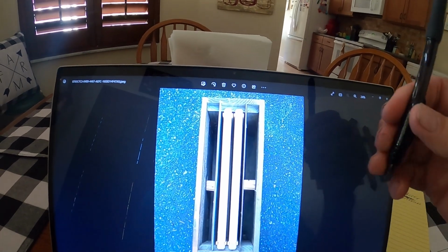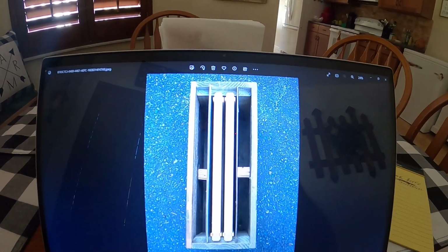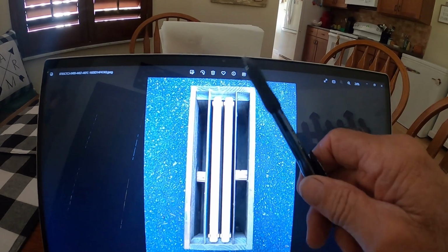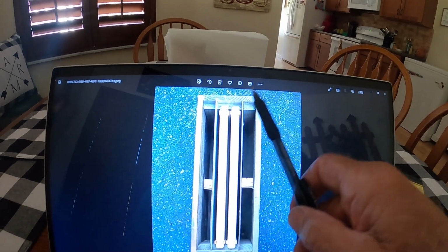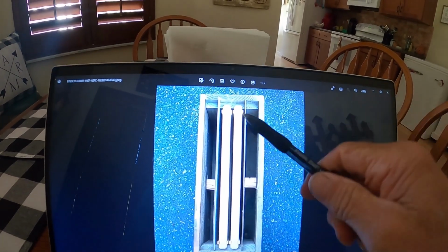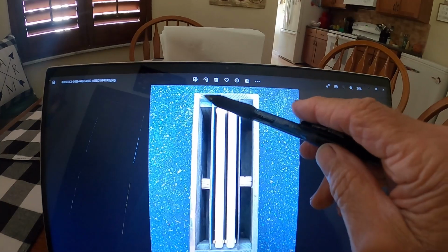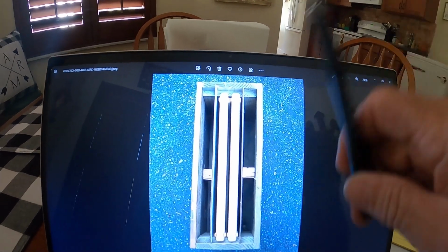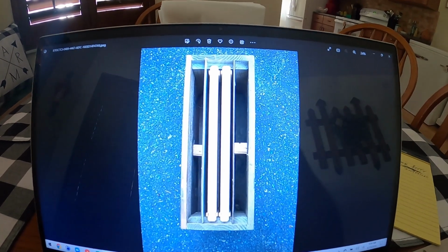I built five of the two frame boxes, but I think I'm going to discontinue that. Use what I have, of course, but I have a lot of 2x ends. They're already pre-cut to 10 inch. I'm going to do a scarf and glue job with a little sliver. If you take two 2x4s and glue them together, you're not going to have enough room to make a five frame box. You're going to have to add a sliver of wood here, which is no biggie for me. I would take probably a 1/2 inch slice. I've got to throw the tape measure on to see what I need to create the box. But anyway, I've done this before. I've glued 2x4s together to make a five frame Beefy. But this is very cool.